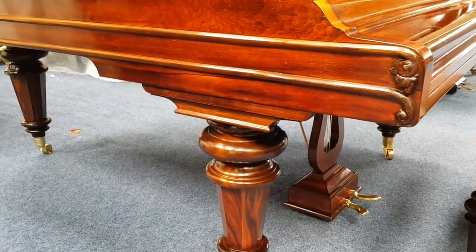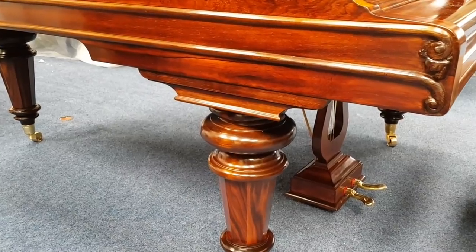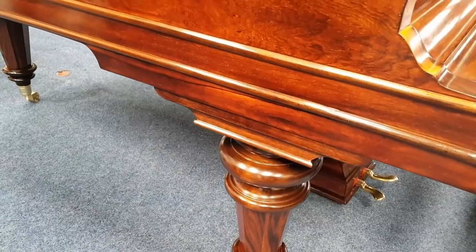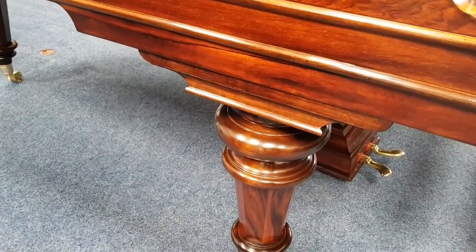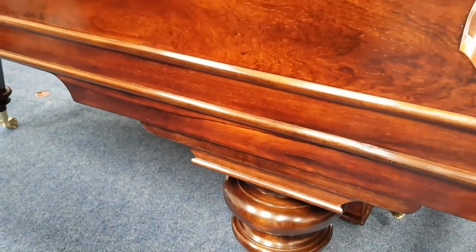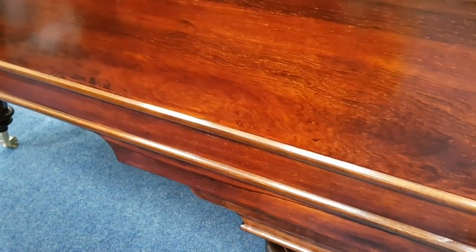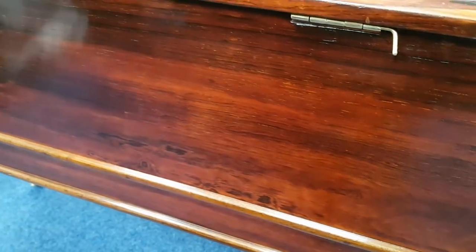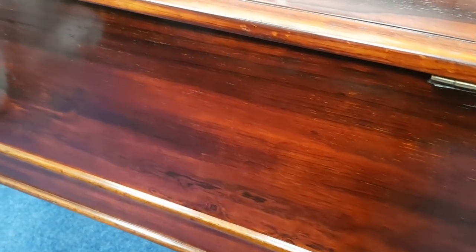Here's the long side of the piano. Legs, by the way, are never rosewood — they're usually beech nowadays and they have to be faked in to make them look like the rest of the piano. So it requires quite a lot of artistry to get them to match, and getting the colour to match can be difficult too. If you look at the long side of the piano, there were a few defects we've had to mask in as well, which were on the veneer itself — rather than re-veneering, it's obviously much nicer to do that.